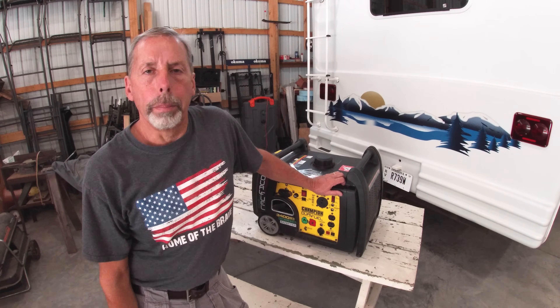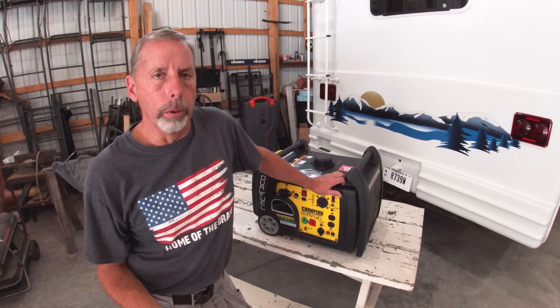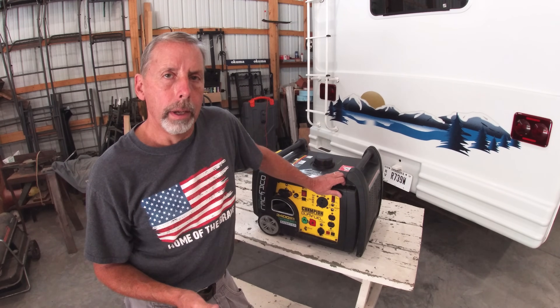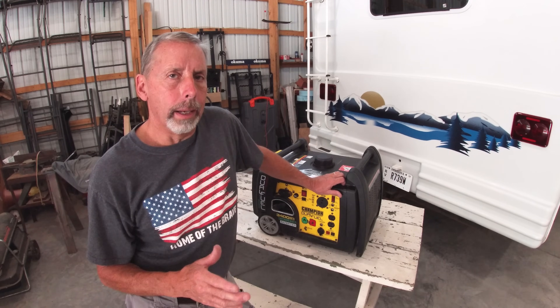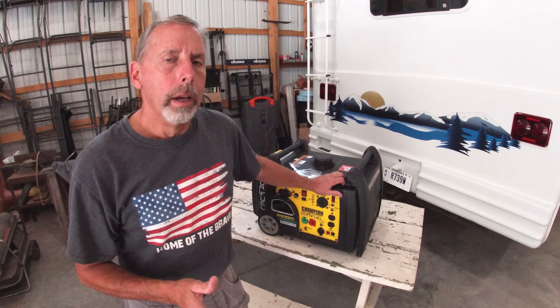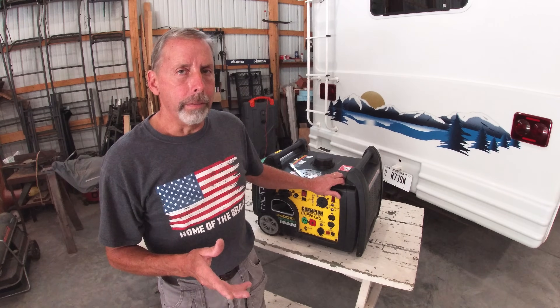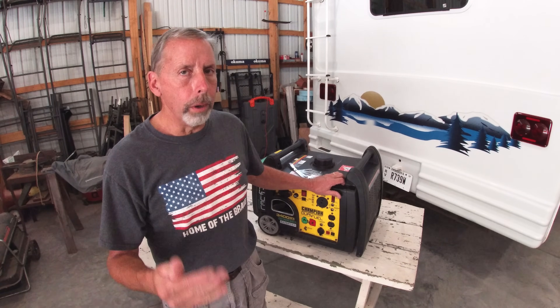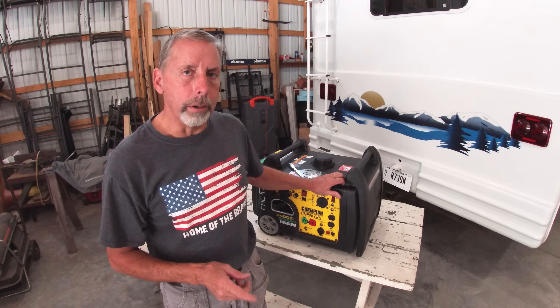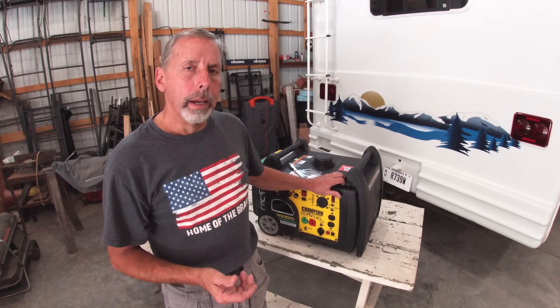Finally, we were planning another trip out west with our RV, so I called Champion again to order a new regulator. I called tech support a third time and got a lady. I told her I wanted to order a new regulator and gave her the model number. She said, why do you want a regulator? I said there's an issue and it's not running right. She said, I don't think you need a new regulator, although the problem could be in the regulator. Before I tell you the problem, you tell me what the symptoms are of a regulator that's not working right. She said: your generator is hard to start, and when it does run, you have to have the choke on. I said, yep, that's exactly right.